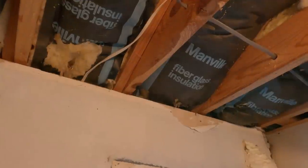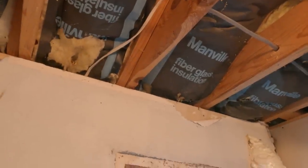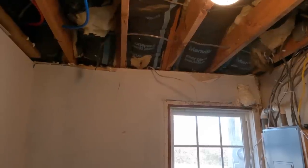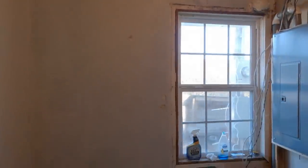Yeah, so that's existing wire we can pull. You know what? That wire may even just be good. Let me see how much of that I can get. If I can reach up there and pull that out, I'm sure that's good. Man, I don't know though. I don't trust the old wire that was in this house. That's why I redid everything anyway. But I think I got 14/2 too. Let me go look. All right, I didn't have enough wire to redo that, but we're just gonna hold off on the ceiling. I'll go tomorrow and get some 14/2.